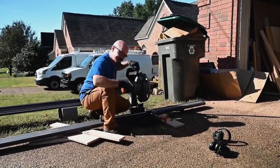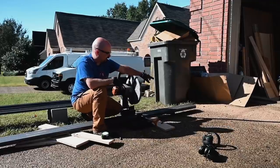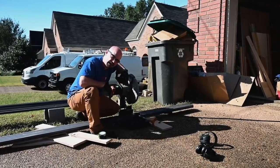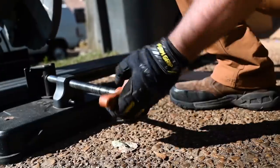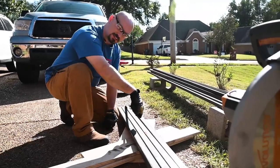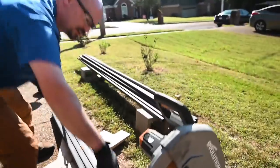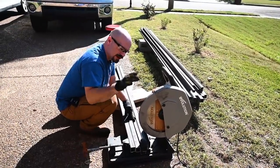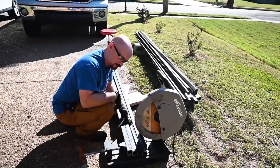One of the things I like about this saw is it's really easy to gang cut — more than one piece — which is pretty common on miter saws. A total of four cuts gets all 16 pieces. The big trick is making sure all my pieces are flush so they all come out the same dimension. I'm also glad it's not as hot as last time I was cutting metal. Instead of sliding pieces all the way through to cut on the same side, I'll pull my measurement from the other end to save some time. I'm cutting with gloves — generally anything that spins, no gloves — but my hands are nowhere near the blade and the metal in the sun gets stupidly hot, so it's a risk I accept.